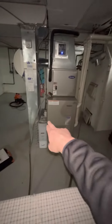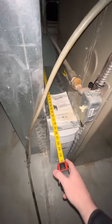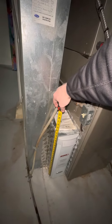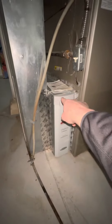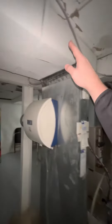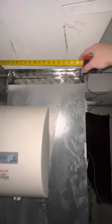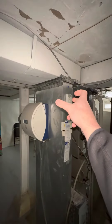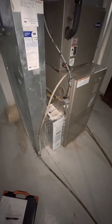It's two-pipe, two inch going out the side of the house. There's a 12x10 filter down here already. Let me double check — 25 by 20... 22, something like that. What we'll probably end up doing is reusing this housing here and bringing a new filter out, because it's already got the side cut in that'll match the return. This unit is only 21 inches wide, so 21 is as wide as we can go. Since that's already cut out, I'll get either a 10 or maybe a 12 by 21 and drop that down — the cutout is already in place.